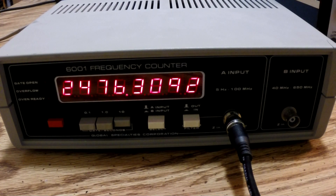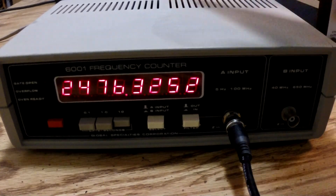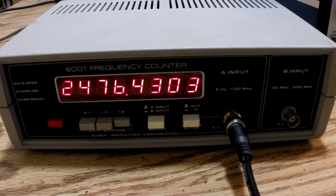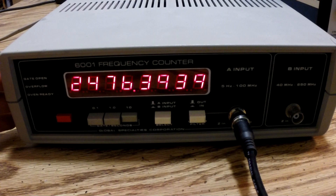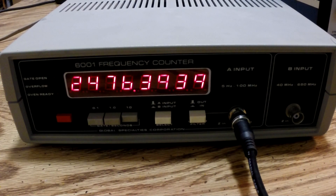Okay, so it's been sitting for a few hours now — just on — and the lights never came on. The unit is very warm to the touch on the outside, and it seems fairly stable. You'll see it's changing a little bit in the last few digits. The oven light never came on, so I don't know what the deal is. I might do some more testing against a known-good frequency counter when I get back to school. All in all, I think I'm pretty pleased with it — it'll do the job. It can accept an external time standard, which I'd like to get, and I can always upgrade when I have the money. Thanks for watching, remember to subscribe, and we'll see you later.